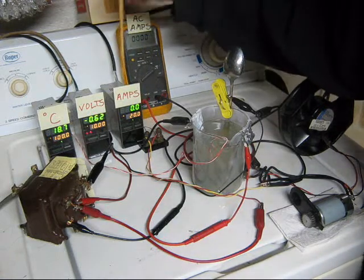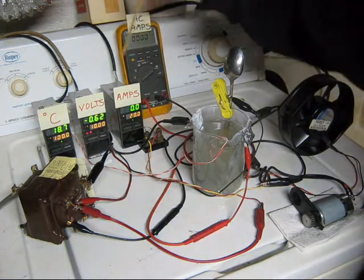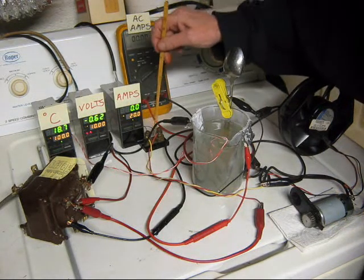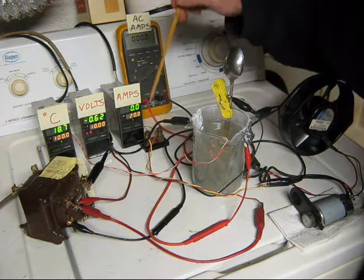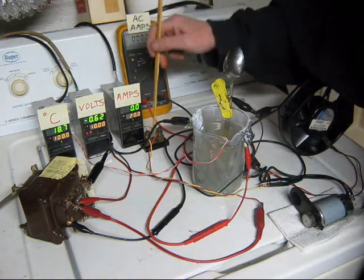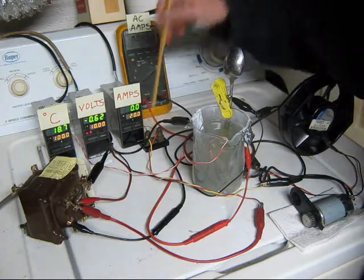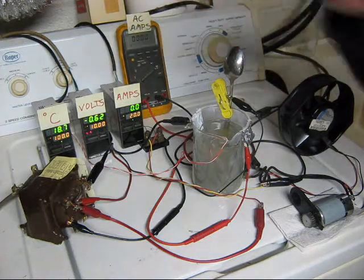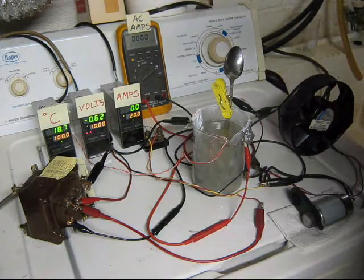The input I'm using is a maximum 10 millivolts, and to give you an idea, it's just a tiny little sip of voltage coming off of this bridge. Shunt, to get current, and these are traceable, calibrated.